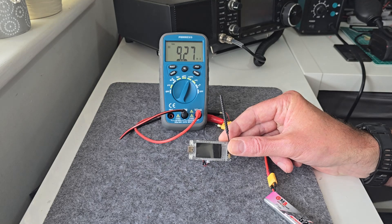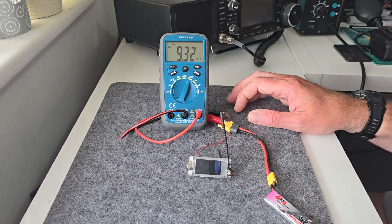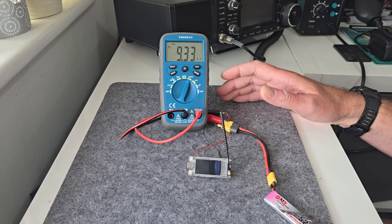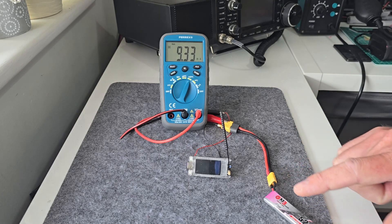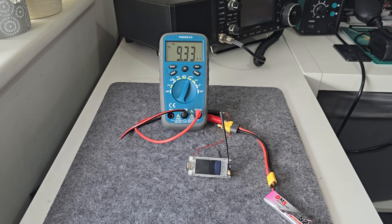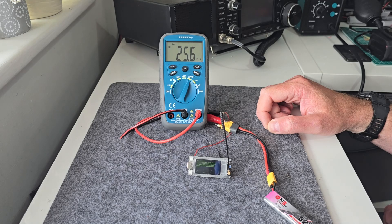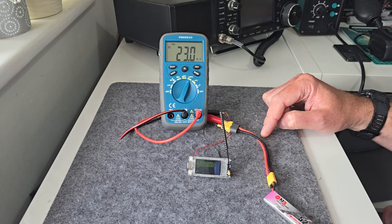So at around 9 milliamps, I'm going to check my phone to make sure it's definitely not connected by Bluetooth. We weren't connected by Bluetooth, but we are now, and it's made absolutely no difference — Bluetooth Low Energy is so low energy anyway. I'm actually going to turn Bluetooth off completely on the device and see if that actually reduces the idle current. I've just turned Bluetooth off and we're doing a reboot, so we'll have to let it settle again. I don't know if disabling Bluetooth in the firmware actually reduces the idle current.